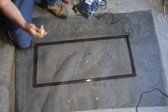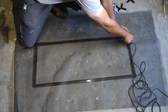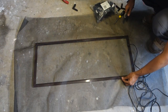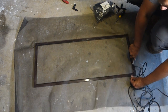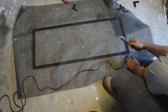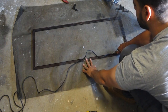Now that we've rolled all the way across, take the screwdriver again and go around the corner, pressing the spline into place. Then roll that edge through. What I like to do is also pull the fly screen just a little bit to make sure we've got tension on there — make sure it's nice and straight. At each corner, take the spline around, push it into position, then use the roller all the way through, putting just a little bit of tension to make sure you're not going to have any sagging sections.